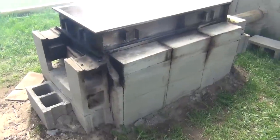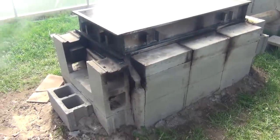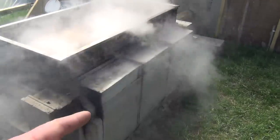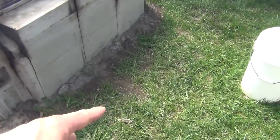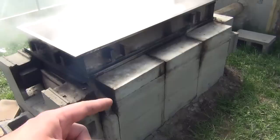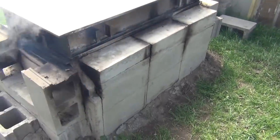The cinder blocks on the outside all look good and nothing's cracked all the way through. They're filled and packed with dirt. Don't fill them with sand — I did that last year. If you fill the cinder blocks with sand and they crack on the inside, all that sand just pours right out. I filled them with the native soil here that's got a lot of organic matter, and it packed down in there really well. So even if the cinder blocks break on the inside, the dirt won't pour out — it'll stay pretty much in place.